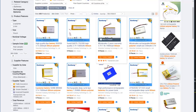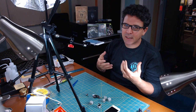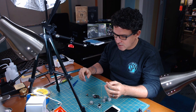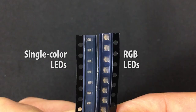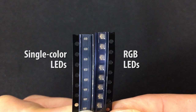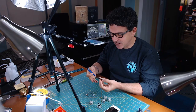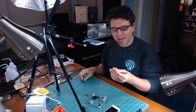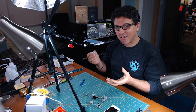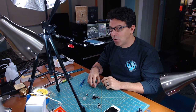The first reason is I really want to switch over to rechargeable batteries. Unfortunately, I haven't been able to find batteries of the right power density that would also fit inside my die — I could get some custom made, but I'd have to order several thousands, so that's not something I could do lightly. The other reason is I really want to switch to RGB LEDs. I just found LED chips about the same size as the ones I'm using now that are full RGB. How cool would it be if the dice could have multiple colors? You could have full color animations, and even have dice that roll really well just get hotter and change color — so when you pick your die, you'd pick up the hot dice, or the opposite, pick up the other ones because they're due.